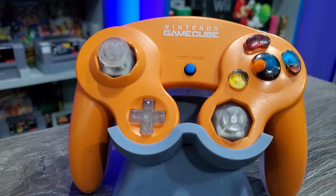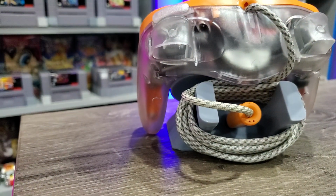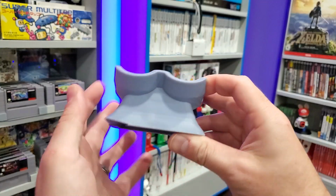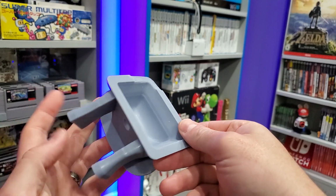That sound is the suction from the prints getting pulled off the FEP film. In the end, neither of these turned out absolutely perfect, but I'm not sure that it's fully the machine's fault, as the models were jammed to the max size of the build plate, and I don't think Chitubox sliced the files correctly, as there seems to be some layers missing.